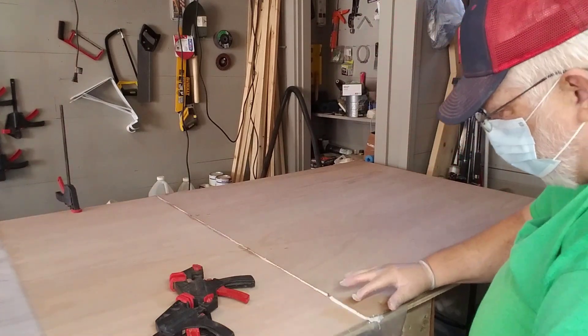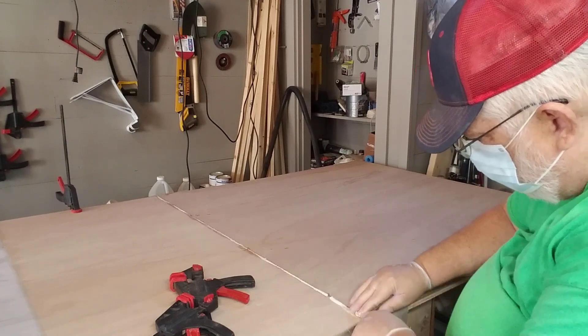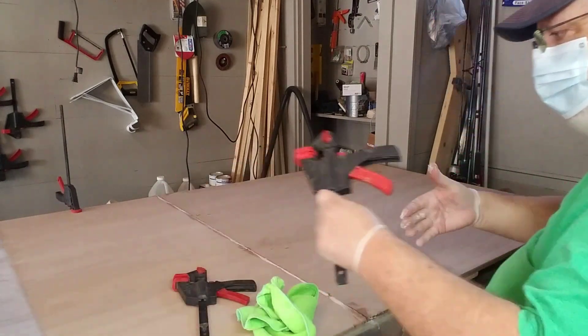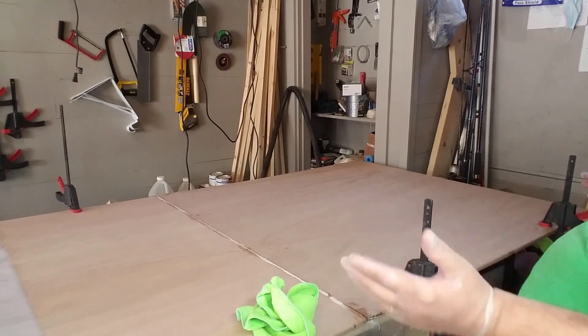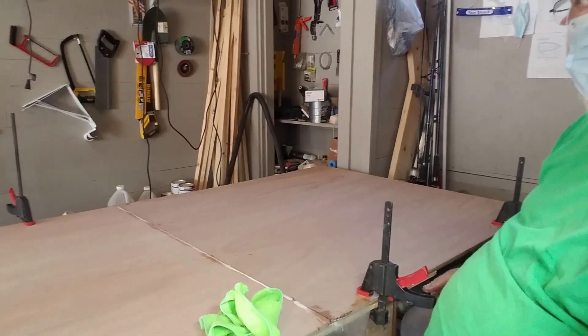Once I have it where I think it should be, I want to make sure it's not too high. There's the top of the scarf right there — that's how it should be. Let's get the wood straight and now I'm going to clamp it to make sure it doesn't move. I'll spread that out a little bit, put plastic on top of it, and then get to the other scarfs. So that's my project for today. Hope you learned a little bit about epoxy and the West System and why I use it — it's very easy to use. I'll see you in the next video. Happy sealing, bye bye!